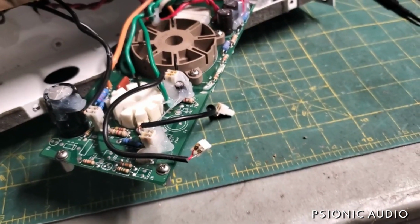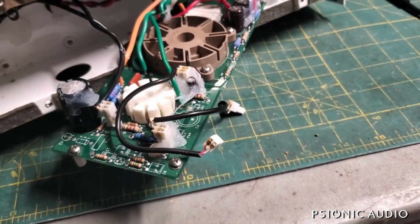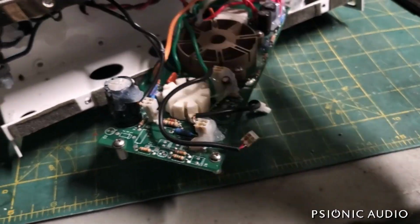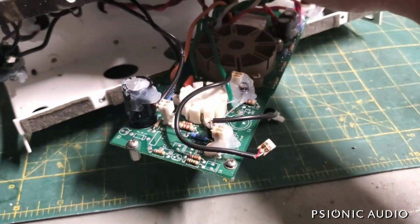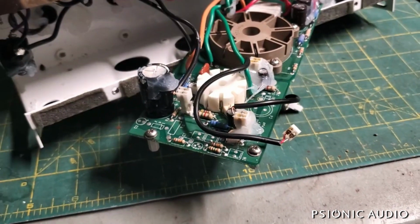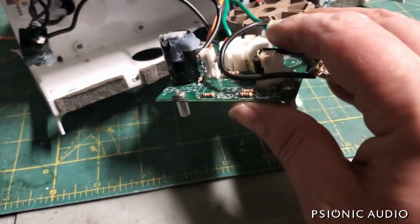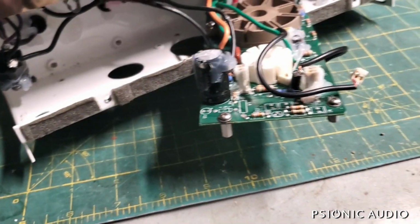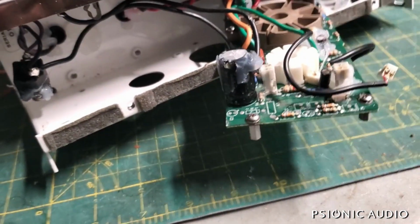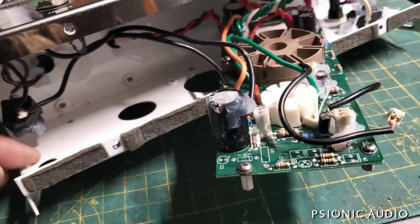I'll probably just put a 50 microfarad in there because 100 microfarads does absolutely nothing for an amp of this size with a single-ended tube and a small output transformer. It's a mythology that Bill M, to a large degree, rest in peace, started with his 100 microfarads into his Juniors. Like it'll magically stiffen things up and give you more low end out of a tiny transformer with EL84s.